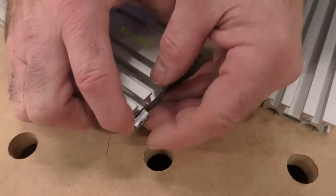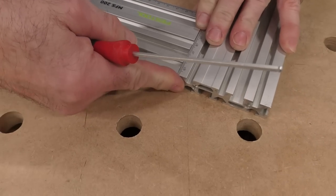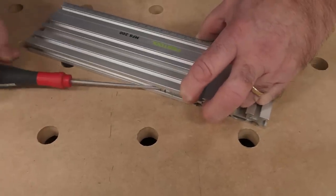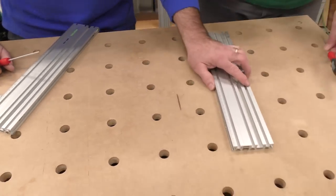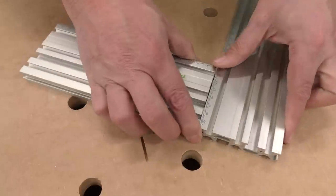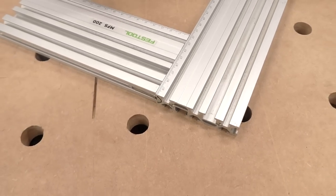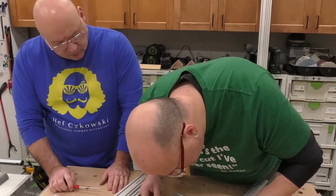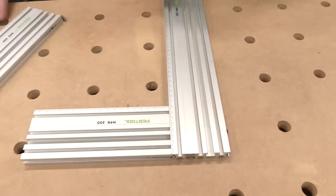Now we have to join the two right angles together. They're very precise, very tight tolerance, and this can be frustrating. The original way is to take the U-bolt and try to balance both pieces while getting them started — they match up perfectly but rocking them back and forth to get them together was really problematic, especially with larger 700mm pieces. My favorite solution is to use a clamping element as a third hand. Back the U-bolt out completely, clamp one piece to hold it steady, use the indexing pins to get it started, and it falls right in.